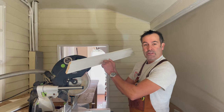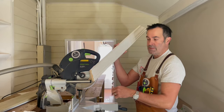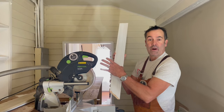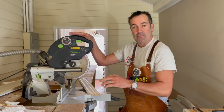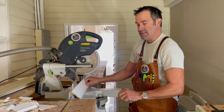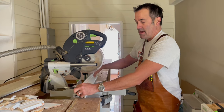Crown molding detail: generally the smaller ridge is the bottom and the smooth long side is the top. This is four-and-a-quarter-inch molding — it's a good size for starting out. I wouldn't advise going any bigger than that on your first projects because any mistakes are magnified the wider the molding gets. A miter saw is a must; if you don't have one you can always rent one. Another must is a taller fence, because I'm going to show you how to cut it on the actual fence and not on the flat. Cutting on the flat refers to cutting a double compound miter; it's a lot easier to cut it actually standing it into place.